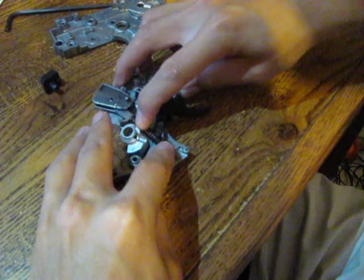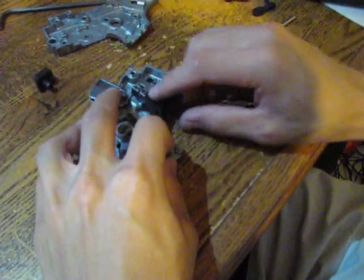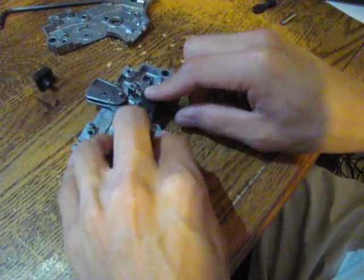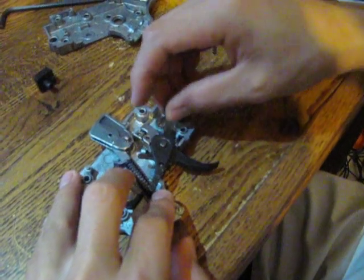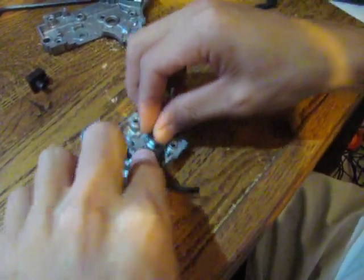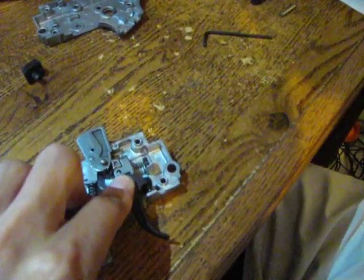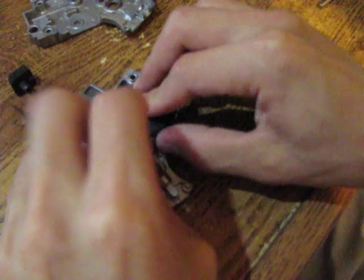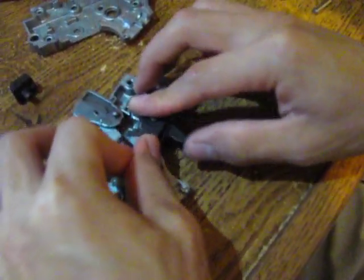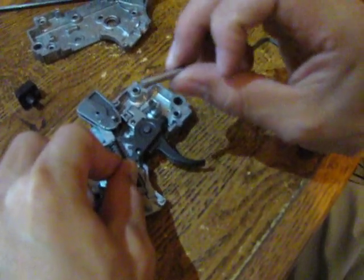Keep your finger on that or use tape — whichever works best for you. You do need two hands for this. Work on the hammer release mechanism and put that one in — put the spring in forward and then down into the socket. It should look like that with this spring visible and another spring down below. Hold everything in place. The piece that holds the two pieces together can actually go in last.